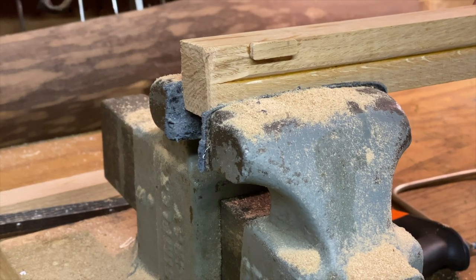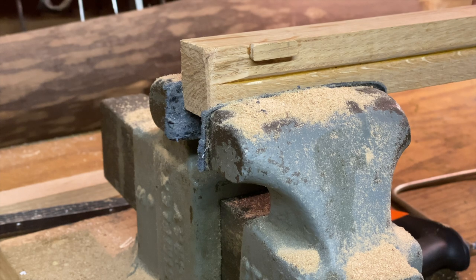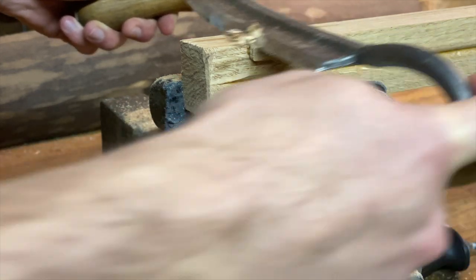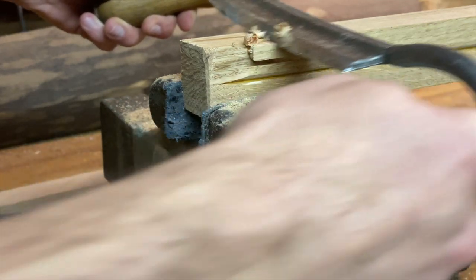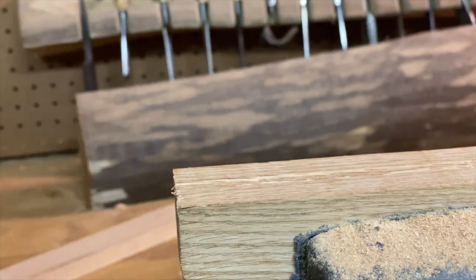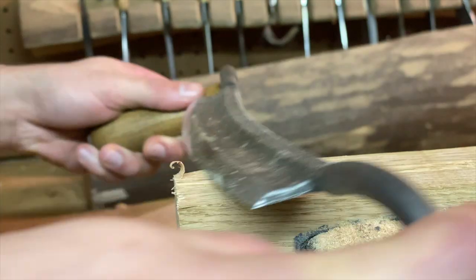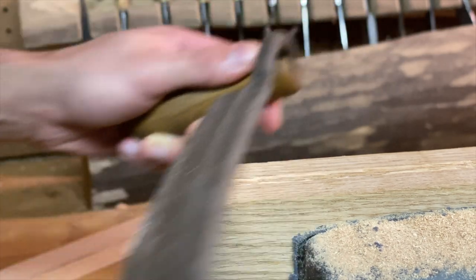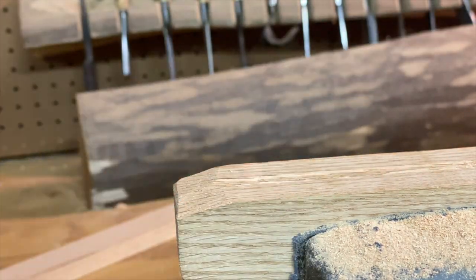I glued the spacers to the barrel half of the device, and not the magazine side, but it doesn't matter, you could put them on either side. After cleaning up the edges with a draw knife, I widened up the mouths of both sides of the barrel, just to give the bolts a clean escape. After that's done, I'll drill the access hole in the magazine, that way you can clear jams quickly.